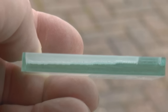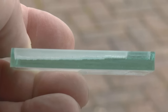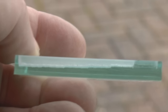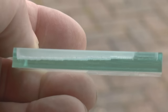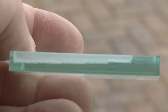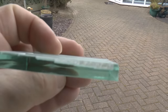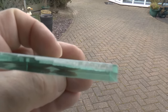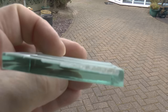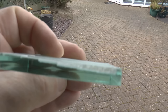I think when we look at that last one in a very good light, we can certainly see we've got depth, but look at the difference between the first steps. That's probably because the power is divided disproportionately in the higher band rather than down at the low end. Whereas when we look at the start, with this first one, we knew that we had a linear relationship between power and percentage. So we would expect more even steps on the grayscale. And we sort of have.